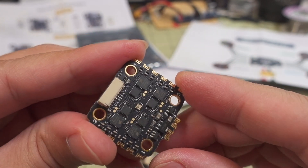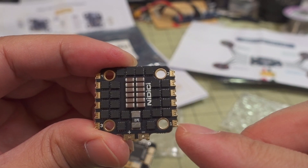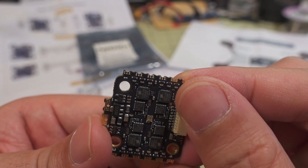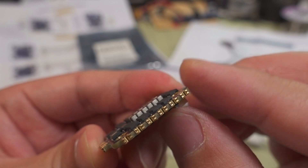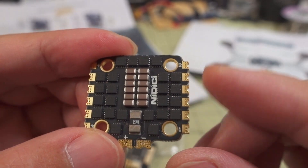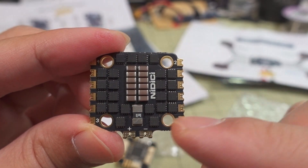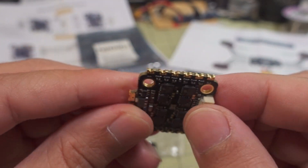Looking at the orientation — motor one is over here, so this orientation should be like this. You get your plus and minus, holes for your capacitor, and motor pads for the motor wires. Pretty nice. It's not a super thick board. You can also solder to the side of the board for the motor wires if you'd like — it's fairly close to the FETs, but should still be workable with average to decent soldering skills. Motor one here, motor two here, plug should be on the bottom.